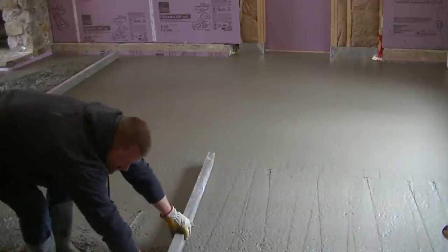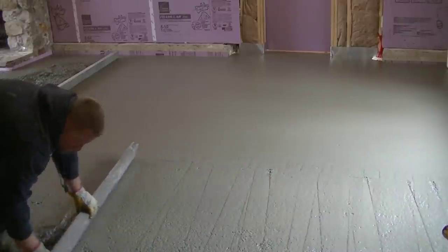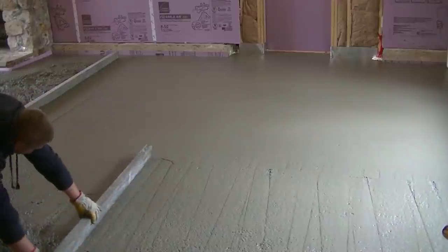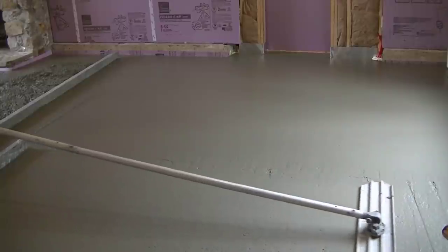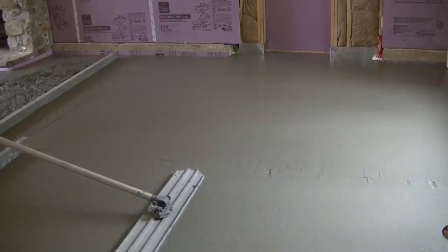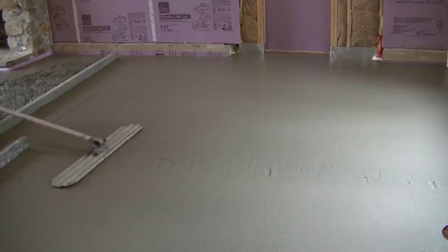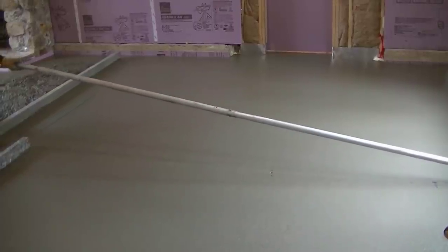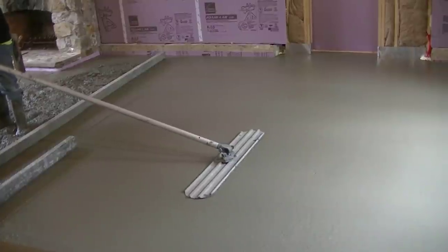Luke's finishing up the other little piece — there was about a five-foot piece over here to get to the wall. He's finishing that up with a seven-foot screed. With smaller screeds, sometimes we'll kick them by ourselves, or if there's a free hand another guy will step on there and help. You can see just how easy that closes up — usually once down and back and it's good. When it closes up nice and tight like that, that makes the finishing a lot easier.